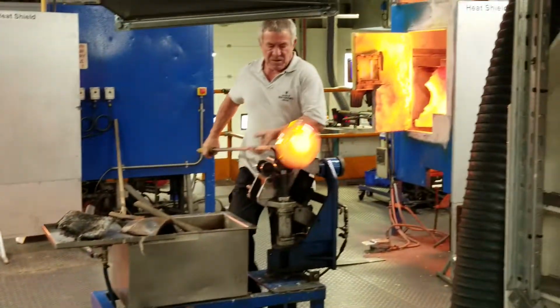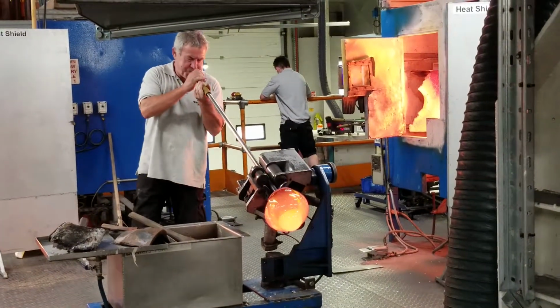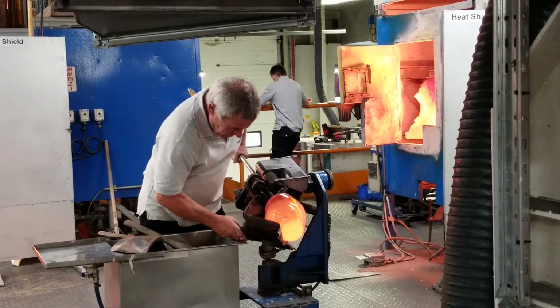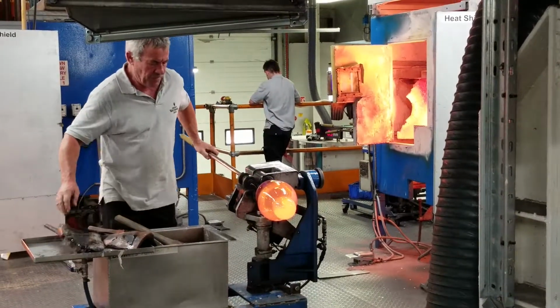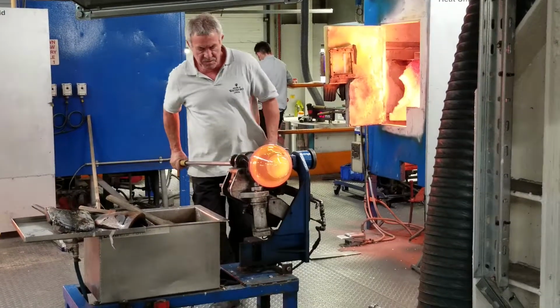So now for the second time you will see the craftsman putting the molten crystal piece up on the turntable, blowing through the blowing rod. This creates the hollow in the center of the piece. And then for the final time, just making the shape there with the handheld wooden tool. So you can see there the shape starting to come more into vision,